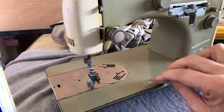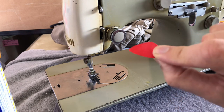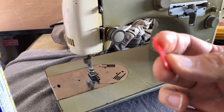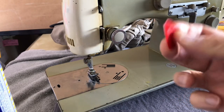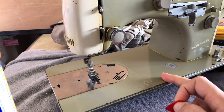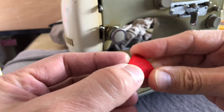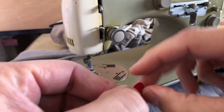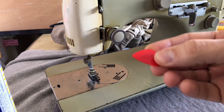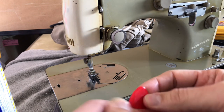This yellow right here is the remnants of the masking tape. Now, this is a guitar pick — it's nice and flat, has an edge to it but it's somewhat rounded. You still have to be careful: even something like this can end up scratching your machine because a lot of these paint finishes are very old. Also, this pick has a texture on it to help people hold on while playing guitar — you don't want that texture scraping on your paint. You want to use this edge.